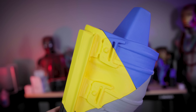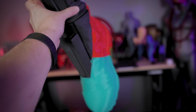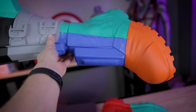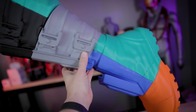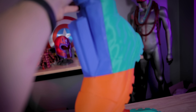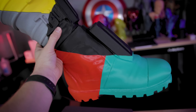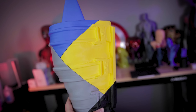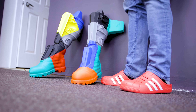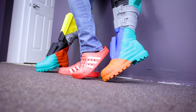In the very near future I'll be going back to reinforce the seams by filling them in and smoothing them out using techniques I recently showed off in a previous video. I have to say, this might honestly be one of the coolest things I've ever 3D printed. Printing at a 0.28 millimeter layer height with the 0.6 millimeter nozzle seems to be a great combination for print speed and quality. The prints are looking great — nice and clean. I already have a whole bunch of the thigh pieces for one of the legs printed.